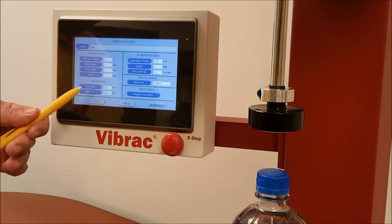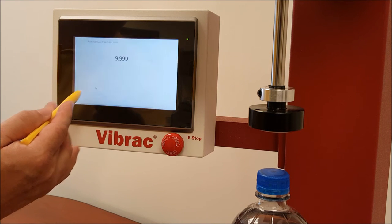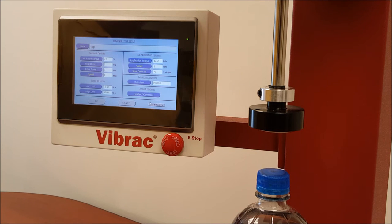The next option under pass-fail limits is setting the low limit of what is an acceptable reading or result of your test. These are limits set in pound-inches or any unit of measurement which you designate in the main programming page. In many cases you would be looking at a removal torque low limit established as a specification for the cap and bottle — let's say six pound-inches. So if we set it to 6.0, it's now set at six pound-inches for a low limit. If during a removal test six pound-inches isn't achieved, it will flag it as a fail or an error.